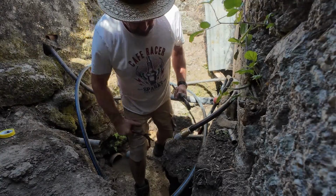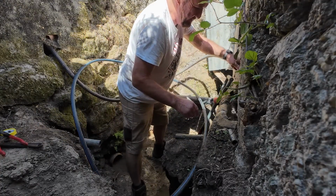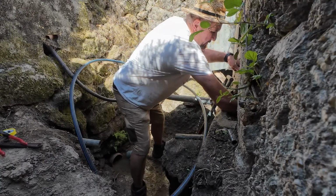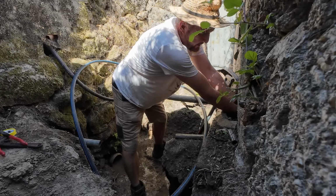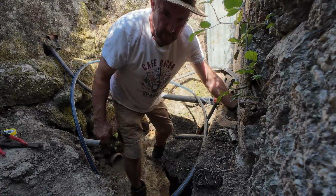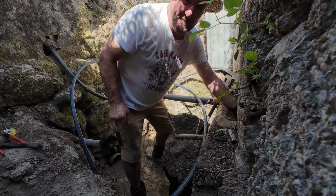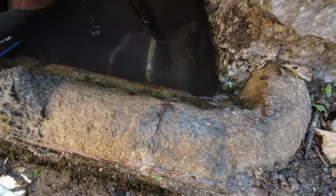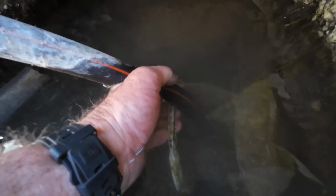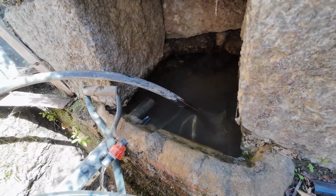There we go. So this can go back in there. Mind the water bowl. What I do need to do is cable tie that back on there. If I'm lucky, my glamorous assistant will go and get me some. Thank you, babe. So what I've done, the new basket and valve are on there, and they're going down into this bucket, and then I'm just going to cable tie that here to stop the pipe, because when the pump cuts in, the pipe does a hydraulic jacking motion, so it's to stop the pipe pulling out of the sump basically.